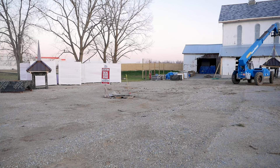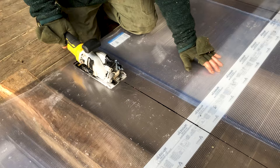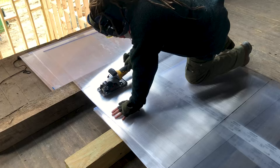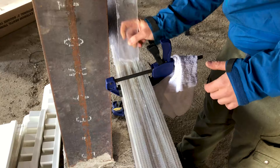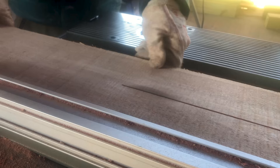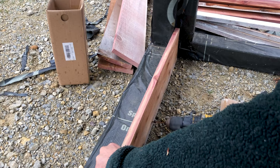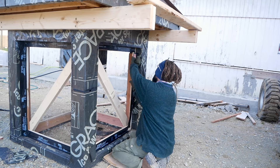We're going to do something similar later to get the old cupolas off the roof. First we need to seal up these holes with a makeshift window before we go any further. The first window layer is greenhouse polycarbonate — we use this because it's got a good insulation value. We build an extra little nailer out of cedar that we can attach the polycarbonate to, and we'll have a watertight window, at least temporary, when these things go on the roof. We get it all sealed in tight with the zip system tape. Then the next job is to make some structural connections for installing the cupolas.